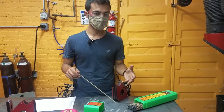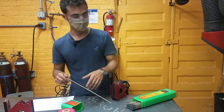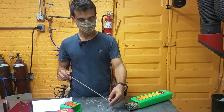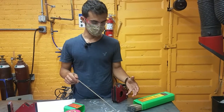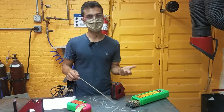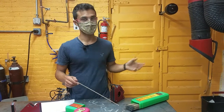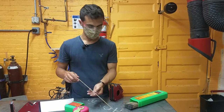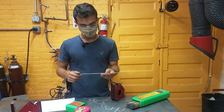One really nice thing about stick welding is you can do it outdoors very easily. There's no gas required, and the flux, as it burns off, creates a cloud of gas to protect the weld from oxygen while it's molten and cooling. That makes this a really good process for outdoors, but it also means it creates a lot of smoke — the fume extractor seems to handle that well.